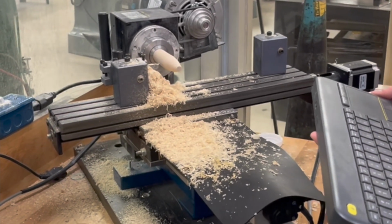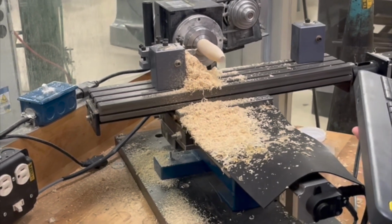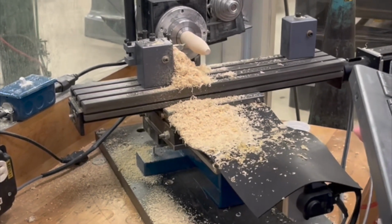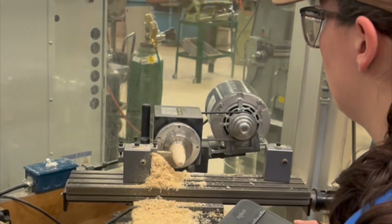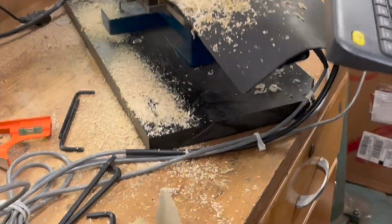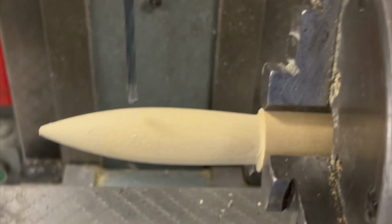The second portion of the manufacturing process that we had to do for these lures was the body, which was a relatively simple cut. We did this again on the CNC lathe to expedite the process. After we put these on the CNC lathe, we used the mills, also in the metals lab, in order to drill the holes in the bodies, which we later regretted, and I'll get into that at a later point.